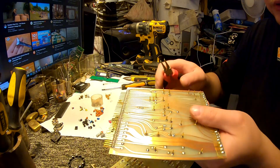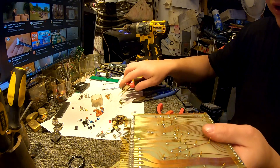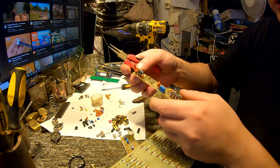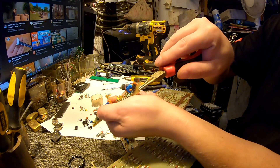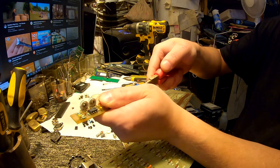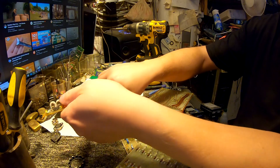Pins — no problem, coming out. What I like the most is I can reach very tight areas — like here with two transistors and one tantalum — I can go in easily, put the pliers in the middle, and push it out together with the legs in most cases.